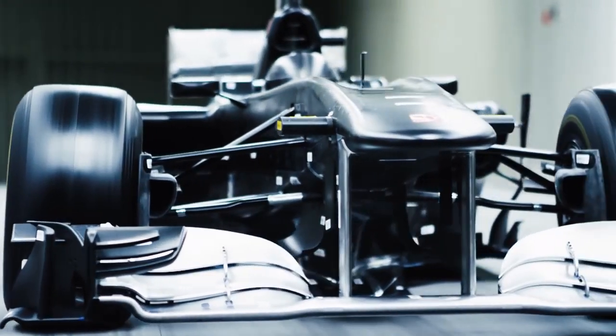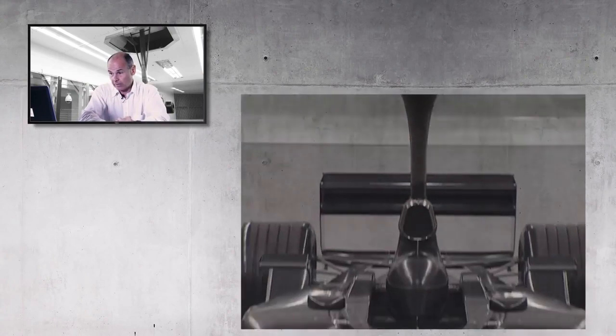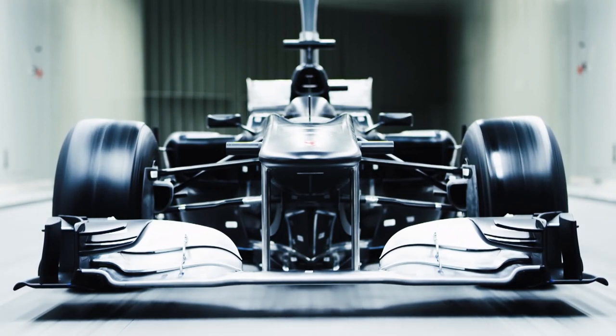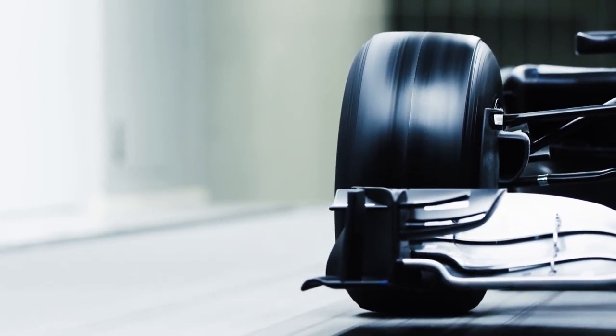We have wheels mounted on our model. I've worked with both wheels mounted on the model and wheels remotely mounted on arms, so that the vibration and the inaccuracy caused by the vibration of the wheels is not transmitted to the measurement systems on the model. But we found over time that the absolute accuracy of having wheels mounted on the model outweighs the slight measurement repeatability problems you have when the vibration of the rotating wheels just slightly reduces your ability to repeat a test precisely. And that's been achieved through experimentation. You try both systems, you see which gives you the best results. And now there is such importance placed on the aerodynamics of the wheel and how that changes the airflow around the car that you really, I feel, need wheels on the model.